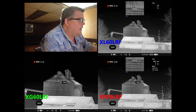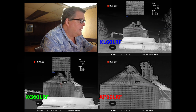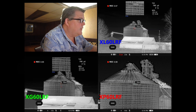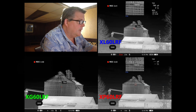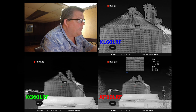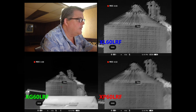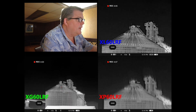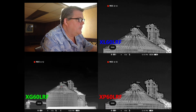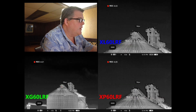You can see where I'll prove that all three units read basically the same reading. You can also pay attention to the detail on the bend — the L and the G are, I would argue, pretty much identical in the display and in the video. The P doesn't have quite the resolution because it's a 640x480 sensor with a wider field of view than the G. The L has the 1024 sensor that lets it do both, giving you the widest field of view in its class along with the highest ID range. For the 640x480 devices coming in at a lower price, you're going to want to pick and choose based on whether it's more important to get more field of view or to get identification range at the cost of field of view.